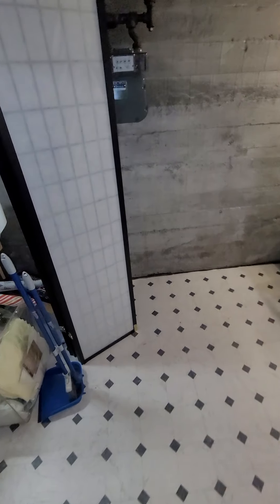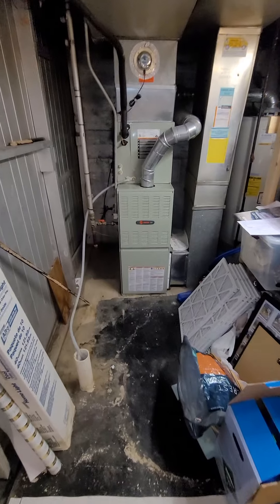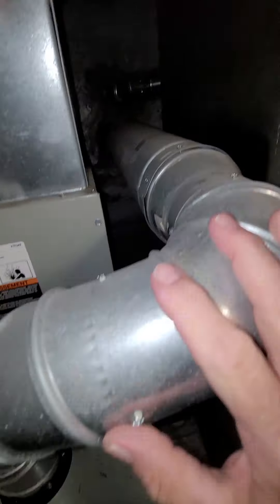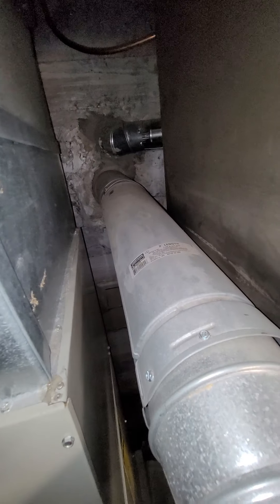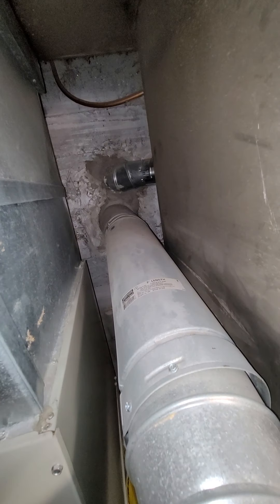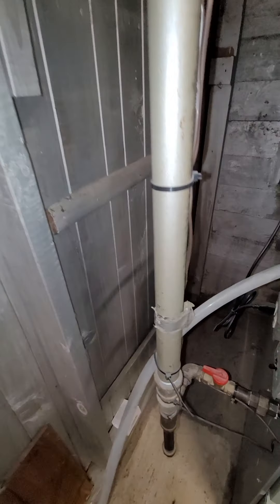Back across to the other room — you have to move some stuff out of the way here — but you've got your furnace and your system. Currently the flue is a four inch. Looks okay coming through, but it looks like it needs a clean out. It does not have a clean out on it, so I have to have a clean out come in on that. There's the water heater right there, it wraps around the side. Gas line coming down, looks like black pipe painted.